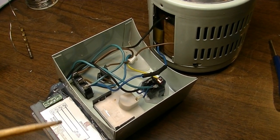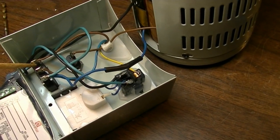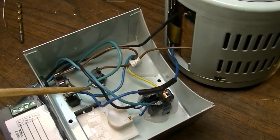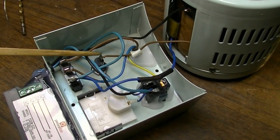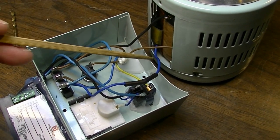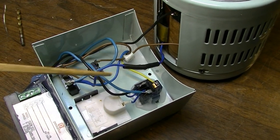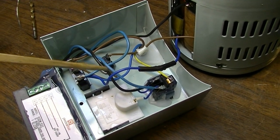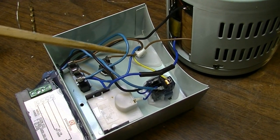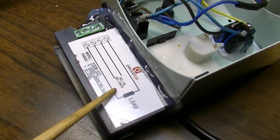Here's a final walkthrough of the wiring. This brown wire is our hot. It comes in here and is left alone. When you close the switch, it comes out of the other side and goes through the fuse and then into the Variac. The neutral wire comes out of the Variac and hooks here and of course goes back out, but it also goes from that point through - that would be the input.